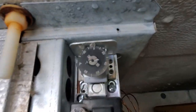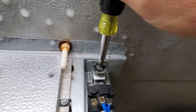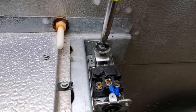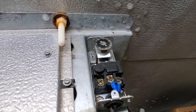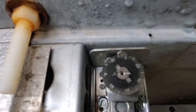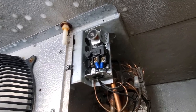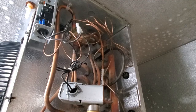The thermostat is set below zero, but that doesn't mean it's working correctly. We have to check calibration. What you can do is just simply turn it warmer — it turns off at positive 6 and turns on at zero. We were set at about negative 6. I've confirmed that the thermostat is working, even though I don't like that style of thermostat. Doing a visual inspection, I don't see any refrigerant leaks. Definitely don't like the way the sensing bulb is ran. We're going to need to put some gauges on this guy and figure out if it's low on charge.